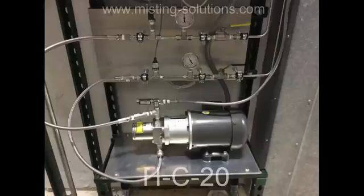This is a video on how to successfully bleed the air out of a pump system after it's been worked on. What I mean by worked on is that the pump has been repaired or replaced. You could also say this is the same procedure you'd use at startup. At startup or after repair, the suction line does not have any water in it, and neither does the discharge line. So we want to bleed the air out and have as much water as possible in those lines.